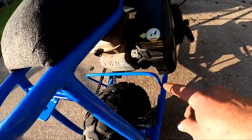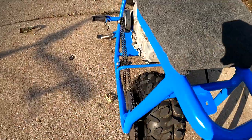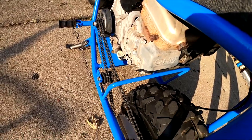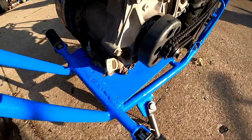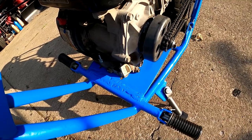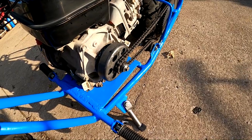We welded on this bracket that the previous owner had sawed off with a solid, I'd say it's like a 3/8 steel rod, bent and welded in place. The motor plate's welds had broken, and we welded on the motor plate, top and bottom.